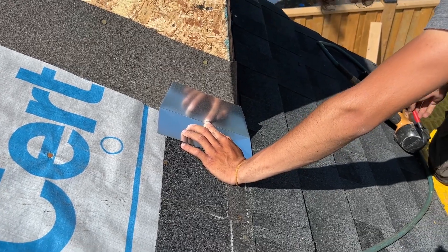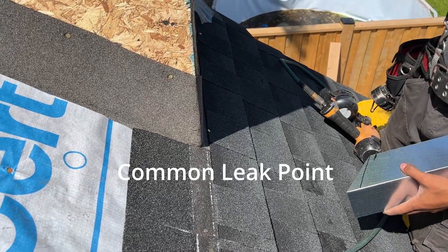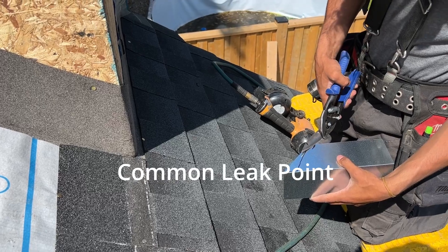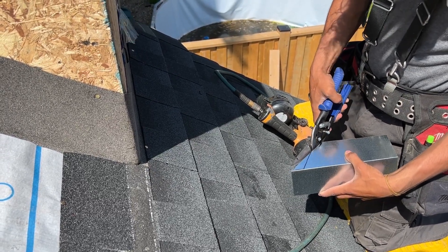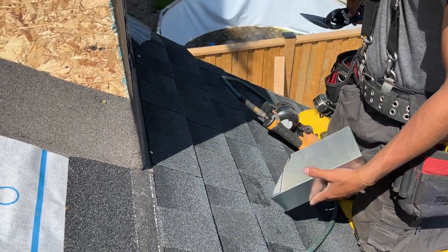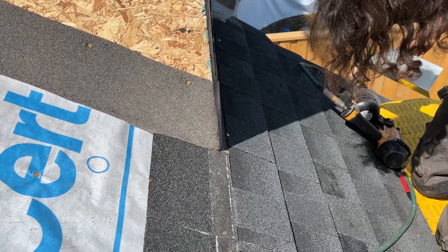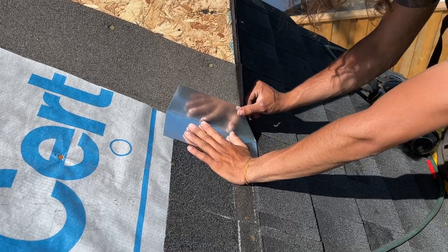This is the most important flashing you ever do on a chimney or skylight — anywhere you've got to do step flashings, the first one is the most important that it's done correctly. Because if not, that is where all the leaks happen, all the rotted wood — from somebody just throwing it in and either doing it backwards, tucking it under the shingle, or not having it drain out on top of the shingle but actually underneath.